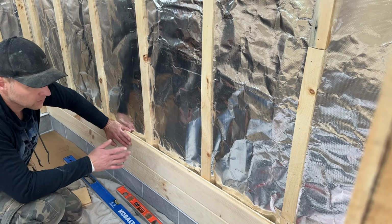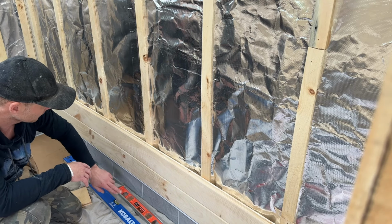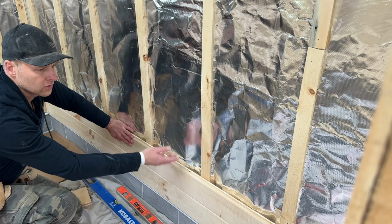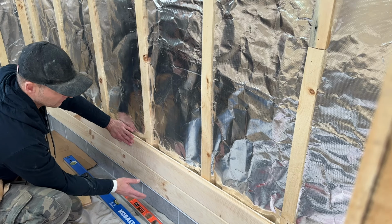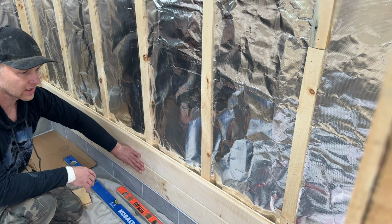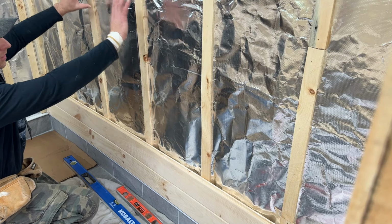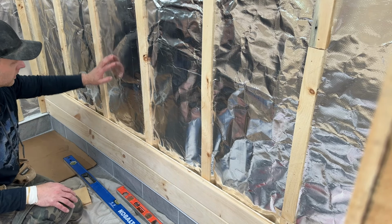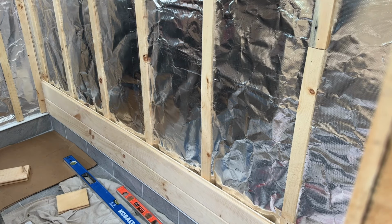So one quick tip about sauna building. You know, usually you want the perfect boards, no knots like this in them, because after a while they can start getting wet and sticky from the sap or whatever coming out. These are kiln dried boards, so I shouldn't have that issue, but just in case, any boards that do have a lot of these, I'm trying to keep them low where it's not as hot and under my bench. I'm still gonna probably put up a little cedar bench rest to lean against, but just in case, gonna keep them low. So just keep going.